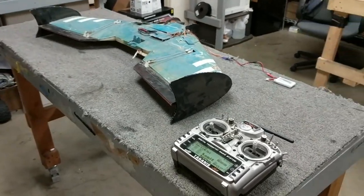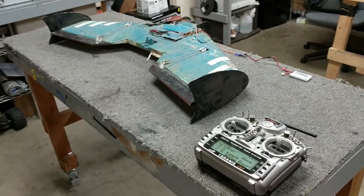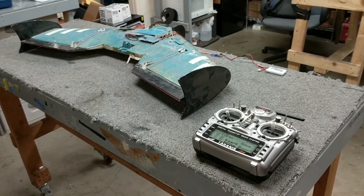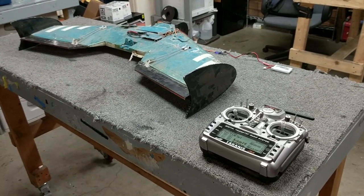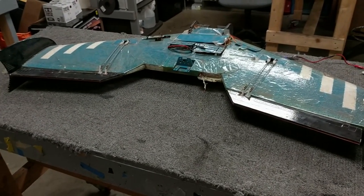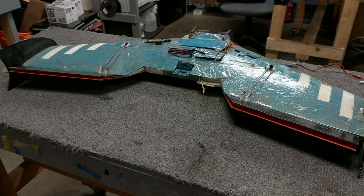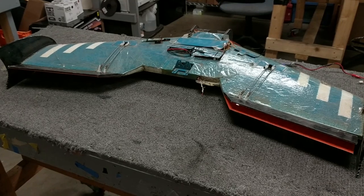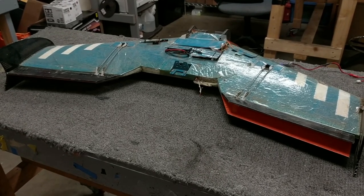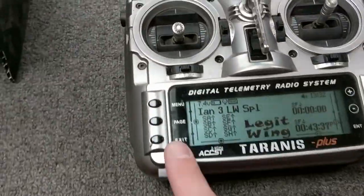You can have mechanical speed brakes like this. You can use the lower throttle to arm or disarm the aircraft, depending on what type of aircraft it is. You can also do things like enable or disable brake on a motor. With the mixes on this, everything works together — you can have a little bit of brake and still use roll and pitch, and you can have rudder and still use pitch or roll. And of course, that's all done in the Taranis.